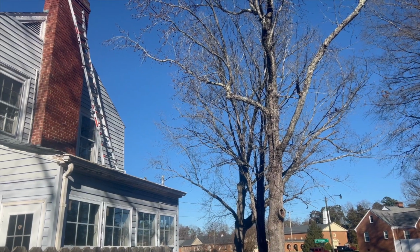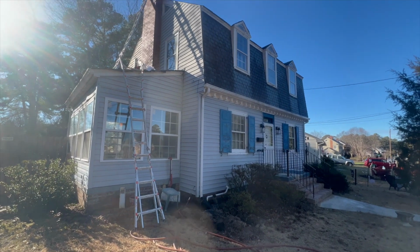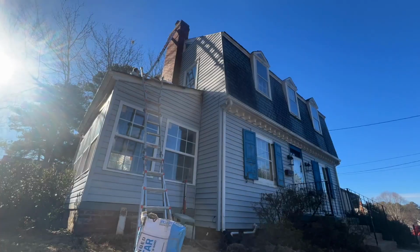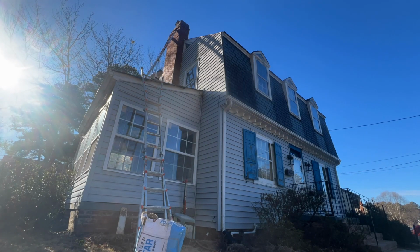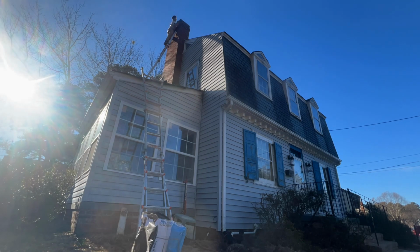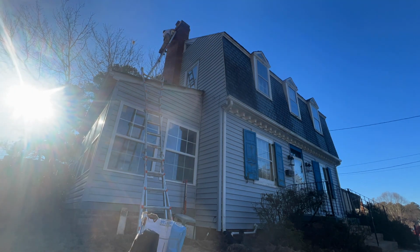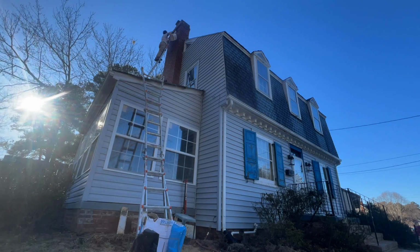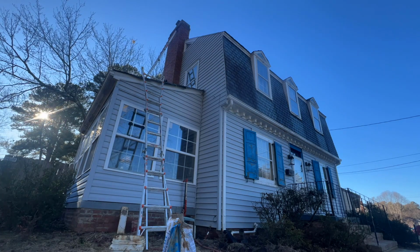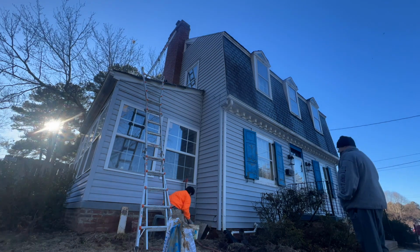While the footing was drying, I went up to inspect the roof. And the slate roof has a little bit of work that needs to be done, but that'll be for another video. My major concern was that the old boiler's flue was left wide open. So I went and I mixed some of the mortar, and I took a block, added it to the chimney stack with the mortar, and I capped off the old flue. I made sure to clean everything off, and I made sure that the mortar and the bricks were all very moist. I then went back and cleaned any pieces of missing mortar from the chimney stack that needed to be addressed at this time, and I applied that mortar.